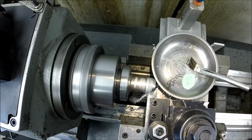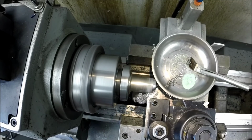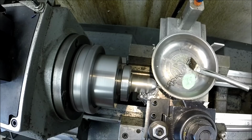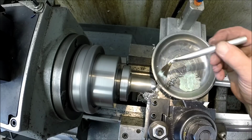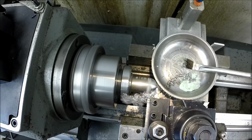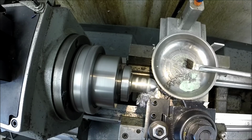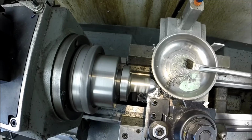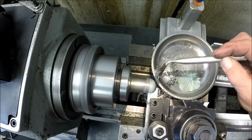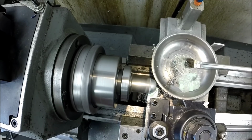It'll cut a form on 1018. It'll cut a form on aluminum, no problem. Yeah, our form's starting to get big. This is where she's going to have the capability of getting chattery on you. There she goes. Yeah, as soon as you start getting a full size on your pattern, that's when they start making noise.